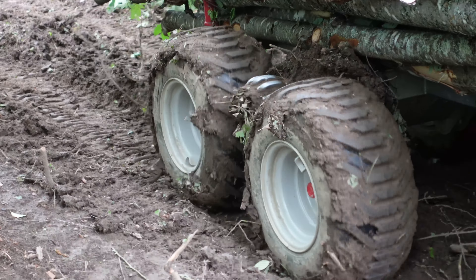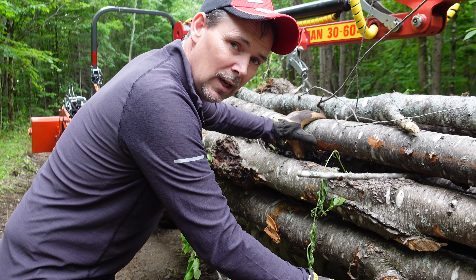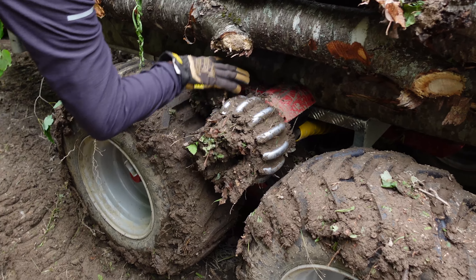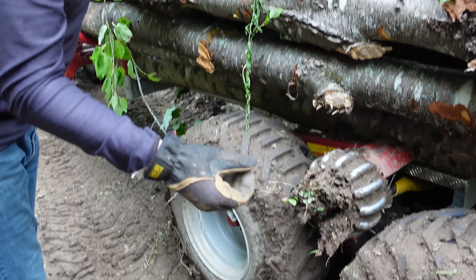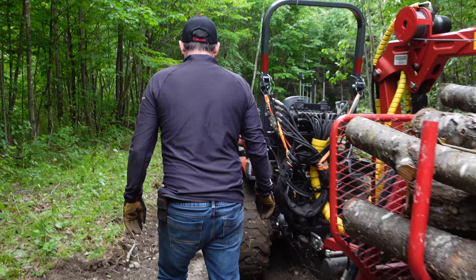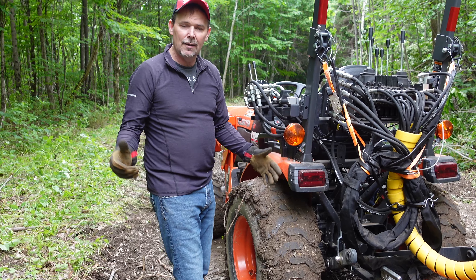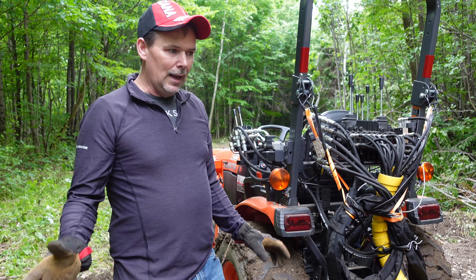Last night, there was so much mud being picked up off this trail that it filled this drive full of mud. I'm not happy with that because I'm worried about doing damage to the hydraulics underneath and maybe ruining a seal or something like that. So I'm going to have to get this wood off and pressure wash all that mud out of there. It even built up mud on top of the frame — this is a slow unit. That's how sticky that mud was, just like a really sticky snow building up on the machine. These are commercial tires, not ag tires — that's what I wanted for low impact on the woodlot. But when you get into mud like this and fill those lugs up, it's just like having a rubber tire roller you'd use on asphalt. So you've got to be careful with that.